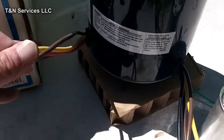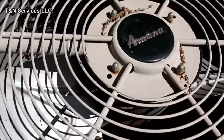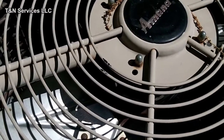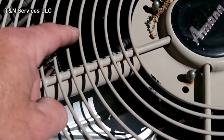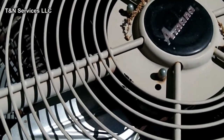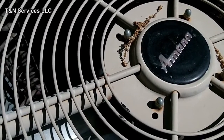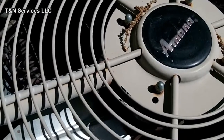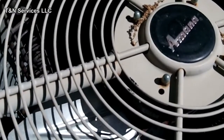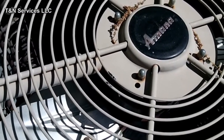The first thing we're going to start off with is the reversible wires. If we go over to the scrap unit, it's still got the factory motor in it and you can see the wire enclosure. In the videos I've watched, they've taken those reversible wires and ran them through and put them back together outside the unit. To me that is very unprofessional for several different reasons — it just looks bad and it is unsafe. The sun will bleach wires, the insulation will deteriorate. Why would you want to take a chance on some kid coming by, unplugging the wires, and getting shocked?